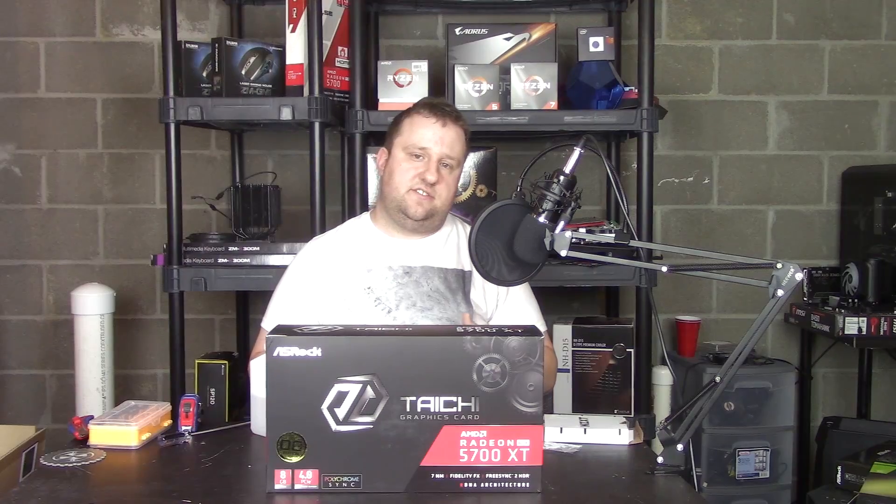I ran all these tests to make sure I didn't make a mistake, but I took it one step further. A guy reached out via the Hardware Swap subreddit saying he had the card too and offered to run benchmarks. His results were a little better than mine, but when we dissected it, he was running 1080p not 1440p, and he was running the silent BIOS. My silent BIOS actually performed three to five degrees better than his. He showed me hotspot temps of 100 to 108 degrees — I capped out around 103 — so a lot of it comes down to ambient temperature.